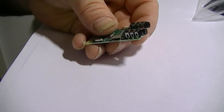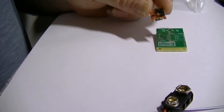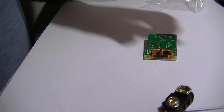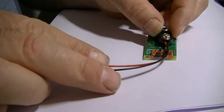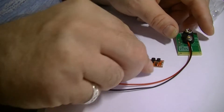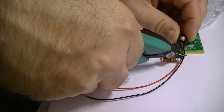Now the way we're going to do this — this is obviously the Bluetooth transmitter, and this is the DC boost converter. What I'm going to do is place that probably underneath here. I need a 9-volt battery connector, which I've got here, so that will go here and power up the boost converter. I'll need to cut the wires to size — about an inch wide.